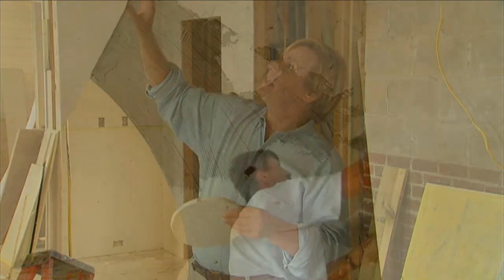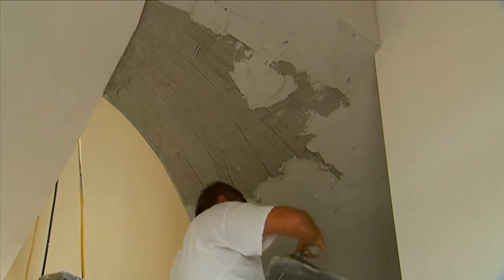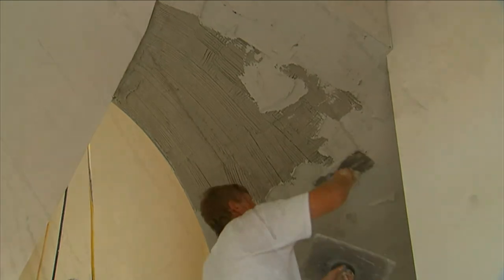In the old days, they actually did plaster walls. In this brick house, you would have had plaster applied to the brick itself, or they would have studded it out, put lath up — little wood strips — and then covered it with plaster and put the finish on it. From here, we'll begin to finish this sheetrock out with a smooth finish, just as you would have seen in a house in the 1840s.